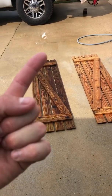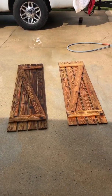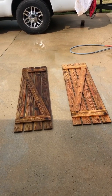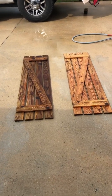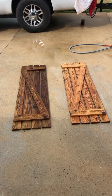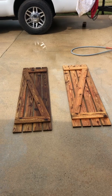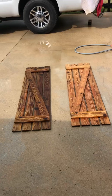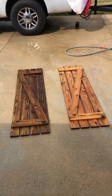The other main benefit is that sodium hydroxide and sodium hypochlorite are both caustics — very caustic at a pH of about 10.5 to 11.5. That means they will oxidize things, essentially rusting them. These shutters are held together with very small, thin brad nails, and just a little bit of rust and those things will snap like toothpicks — because that's about the size of them.